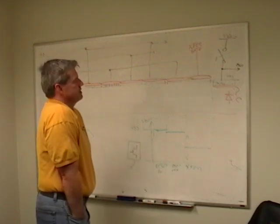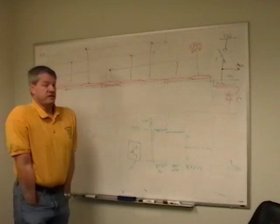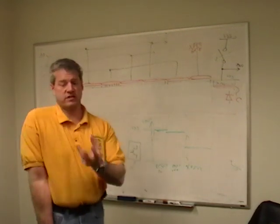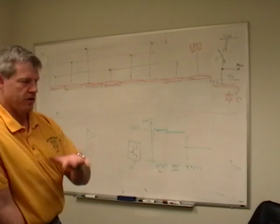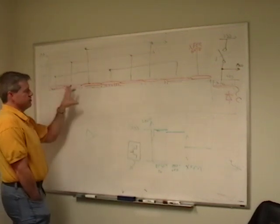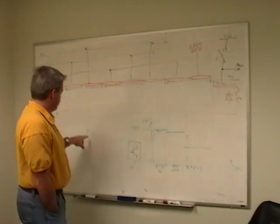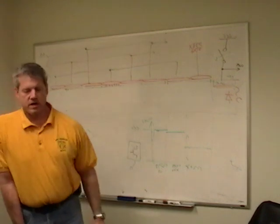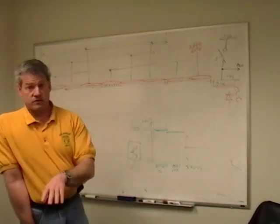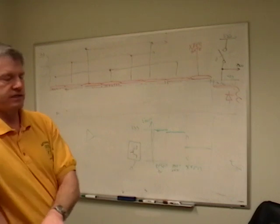So we look at this and we realize right off the bat a couple of things. CCDs are really clean about it. Every bit of this area where a photon can hit gets used, as opposed to a CMOS imager where, unless you're using a stacked array type thing, a bump-on process, you don't get 100% fill factor, and you can get very close to it with a CCD. You don't have electron noise, you don't have all the other noises. You've only got a single noise source besides thermal, and that's the reset switches and your amplifiers coming out. Whereas in a CMOS device, there's all sorts of amplifiers and other things going on in there, so they're generally speaking a lot noisier. They've come a long way in the last 20 years, but if you want to get into astronomical and scientific type imaging, it's almost still all CCDs.